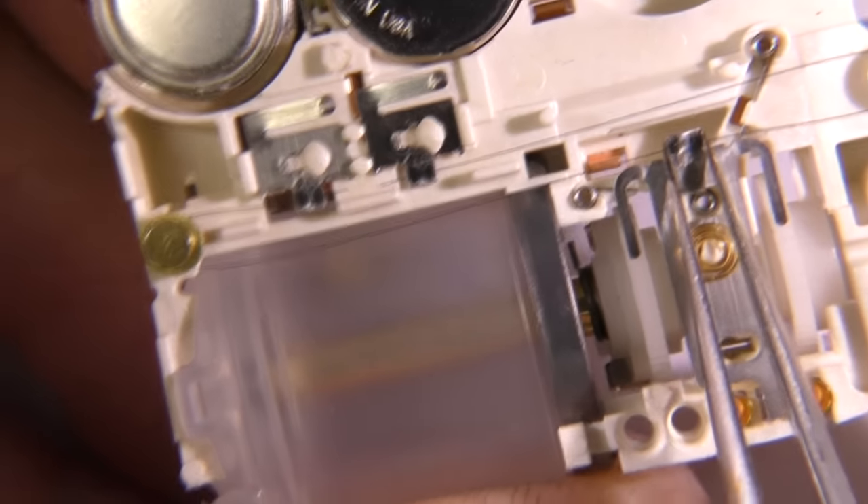I've hooked a couple of diodes up to connect it to my signal generator so a bipolar waveform activates each wire in turn — being thermal it doesn't care about polarity. So that's just ticking away. Let's see how fast we can actually run this. The signal generator hasn't quite got enough juice, and also because it's thermal, timing is probably important — so it's struggling at 1 Hz and just about working at 0.5 Hz. There are about 40 threads on the working part of the piston and about 50 teeth on the ratchet wheel.